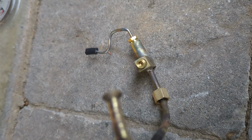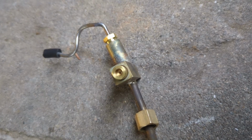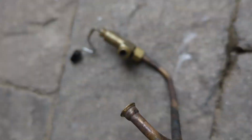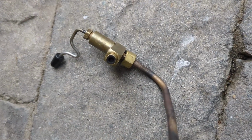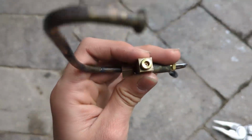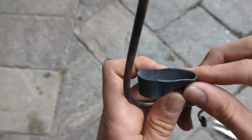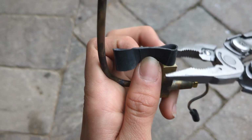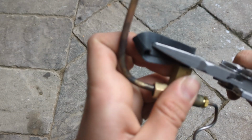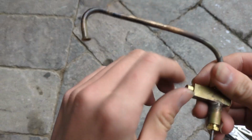Another difference between my part and Coleman's part is that Coleman's part has wrench flats on the gas tip, while mine does not. Quite simply, this was done in order to cut costs. While this is a minor inconvenience, one can simply use a pair of pliers with something like an inner tube or a piece of leather to prevent scratches in order to service the gas tip. Thus, this is a minor inconvenience with a large advantage of saving quite a bit of cost.